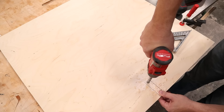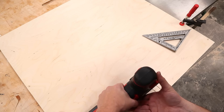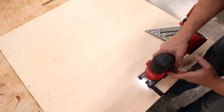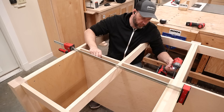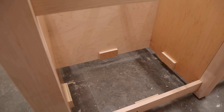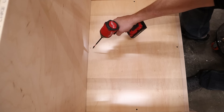This notch is easy enough to cut with a jigsaw, and a drill bit can make a nice little relief to quickly remove the center and clean up the bottom of the notch. Now you can see how it slides over that center support, so I can screw it into the side panels. Down at the bottom, I added some small plywood cleats, and this is going to give me a place to drop in the bottom of the cabinets. Because these cabinets will be filled with drawers, a bottom panel is kind of unnecessary. However, it will keep the cabinets free of dust, cobwebs, and any kind of critter who might try to make their home in here. This also gives you the flexibility that if you don't want all those drawers but would rather have shelves and doors, you can still use this cabinet for storage.